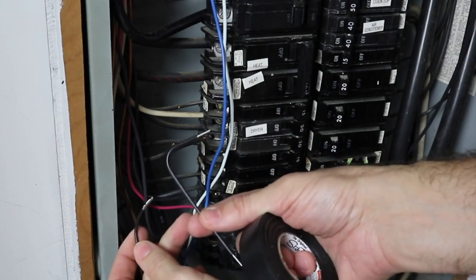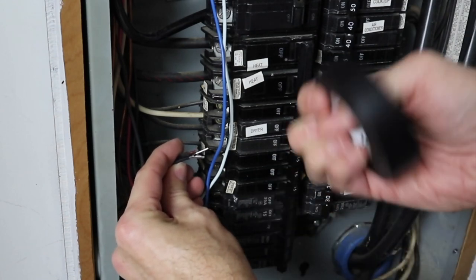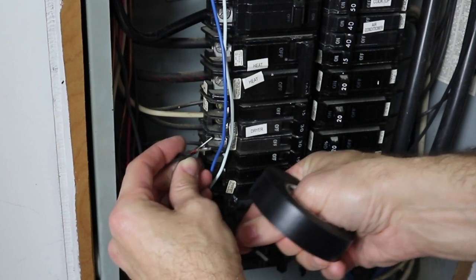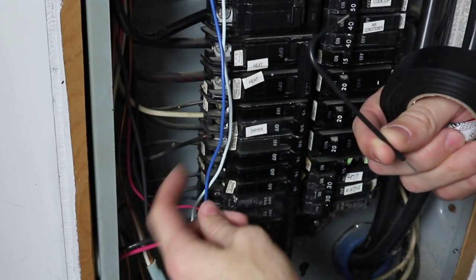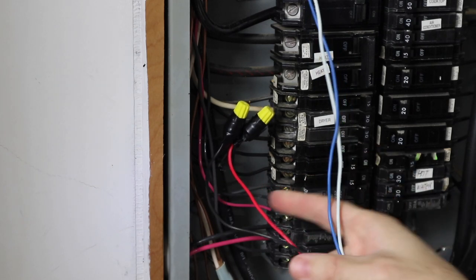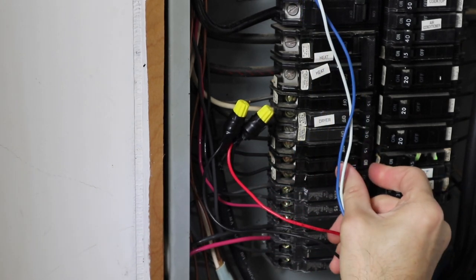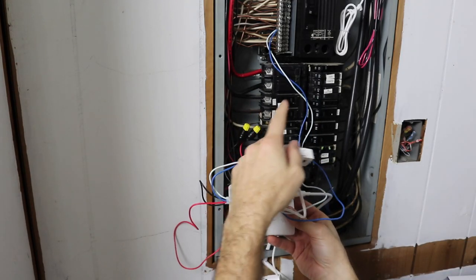To make things easier, you may need a pair of pliers to manipulate wires or to grab that knockout and twist it out. Here are the blue and white wires going to the neutral bar. We found two adjacent 15-amp breakers. I've removed the conductor from one, and we're going to connect one of the power leads from the hub to it. We'll use the jumper provided, connect all three wires together with a wire nut, add electrical tape for security, and then connect the other end of the jumper into the breaker. The two wires power the unit and they're jumped back into these two 15-amp breakers.